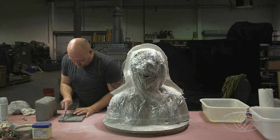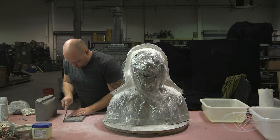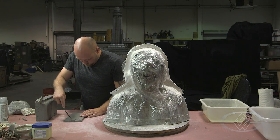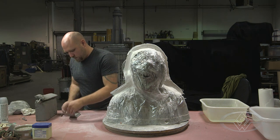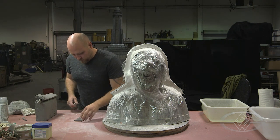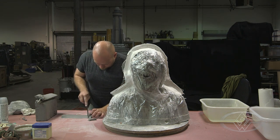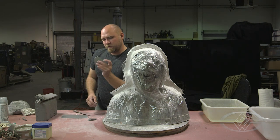I'm only going to make three keys. I'm going to cut a strip at a 90 degree angle and the other one about a 45. So you can see that I have a 45 degree angle on one side, 90 on the back. 90 isn't important because it's going to be on the outside of your mold. I'm going to do another 45 degree angle cut. And that is a key — that's what a key looks like in clay.